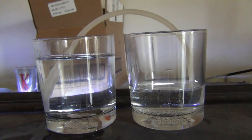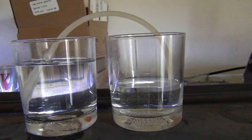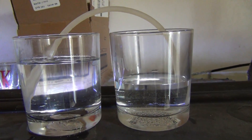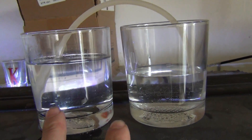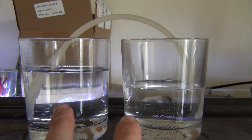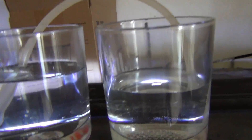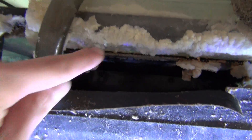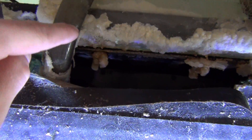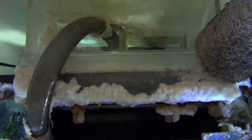As you'll see, when we add water to the black box, it sends it over to the clear box because this wants to equal out the water levels. I've got a small tube so there's a very slow flow, but as you can see, the water levels are equaling out. So what's happening here is when water comes in, it's flowing through into the left side, and then it's able to spill over and go into the drain tube.